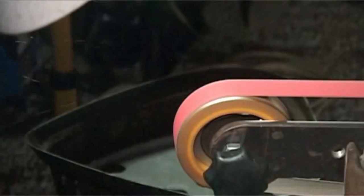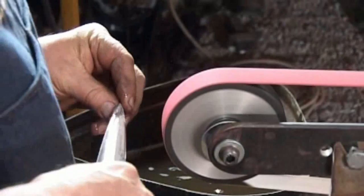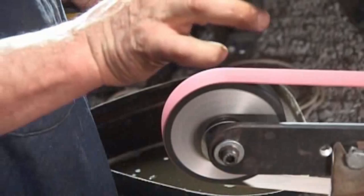Because right at the tip, I'm going to hand work it. And I'm going to do that with a file. After hardening, I do it with a stone. Whether you do it just with a regular carborundum oil stone, or you get the EDM stones that they sell through Toolquip Allied. They come in 220 and 600 grit, and they're 100 long by 20 square. That's the size you want.